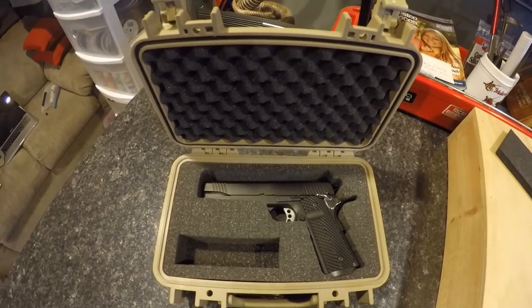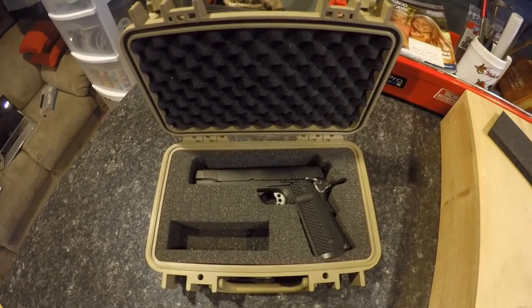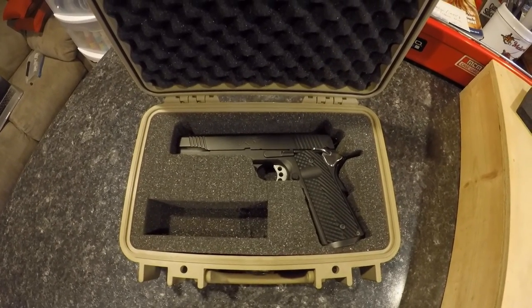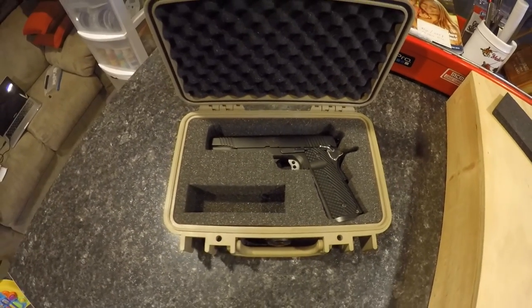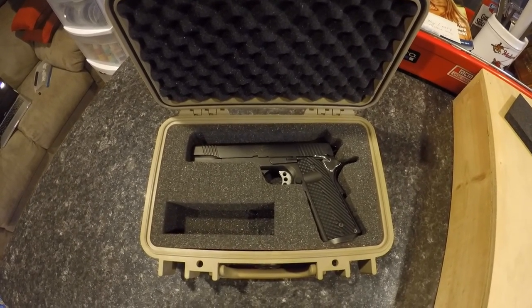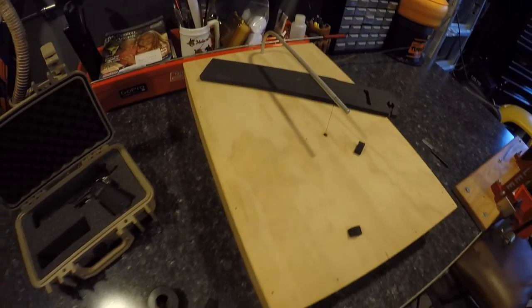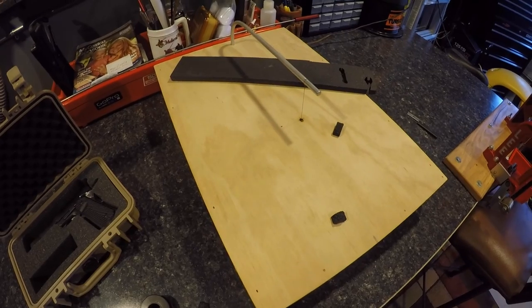It's all in the homework — you just have to build a template of the item, pin the paper or cardboard template to the foam, and then follow the wire along the edge of your template and it'll cut the shape nice and easy. I find it a lot better than fighting with a razor blade, or those electric carving knives. This thing only cost me about $30 to build, and I've used it for numerous gun cases and it's great. Thanks for watching.